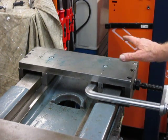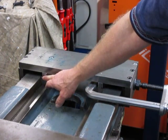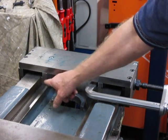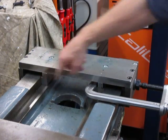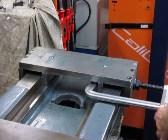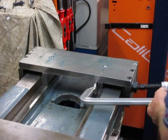What I've done today is I've clamped everything together. I machined out a relief on these parts in the center here so that they will go in underneath the covers. Just see if you can see those covers — what you're seeing here are the way covers. I'll take that clamp off now.